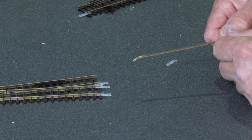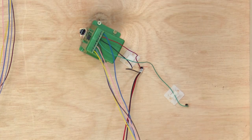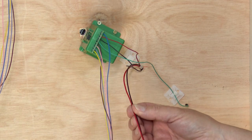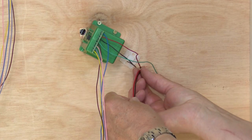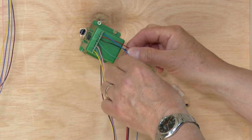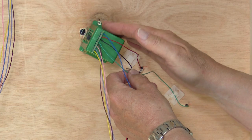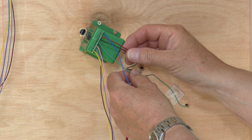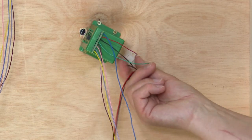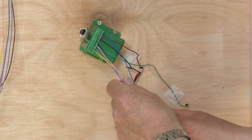Right, get this board up on its side. Well, that's this point motor in place, but what I didn't really explain earlier, I think, was these four cables. These are the two 16/02 cables that go to power the point, and these two 7/02 cables are the ones that bring power to the frog. So when this Tortoise point motor moves one way or the other, it's the feed from either the red or the black cables that go to the frog. And that was the purpose of soldering all four to the point. I do hope that makes sense.